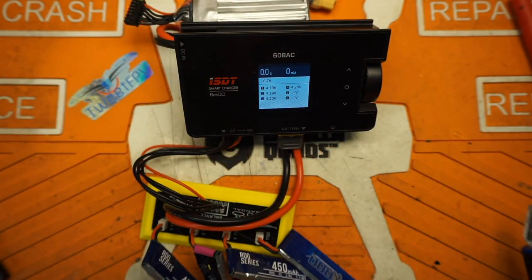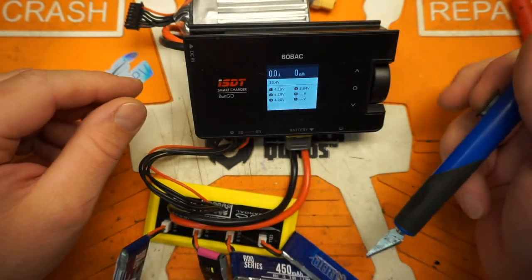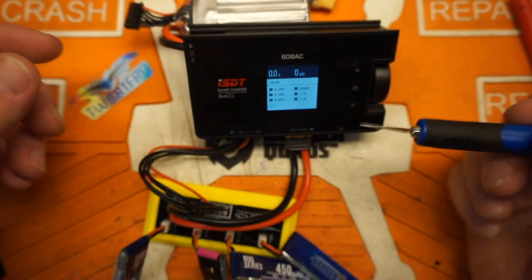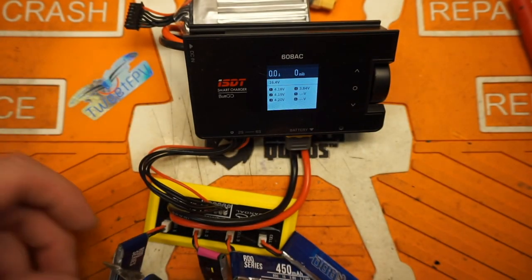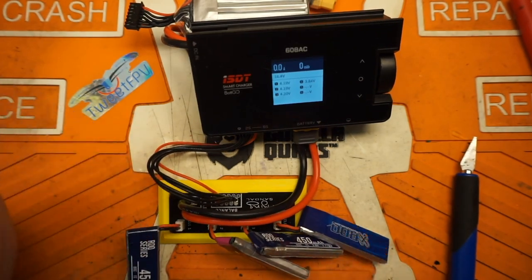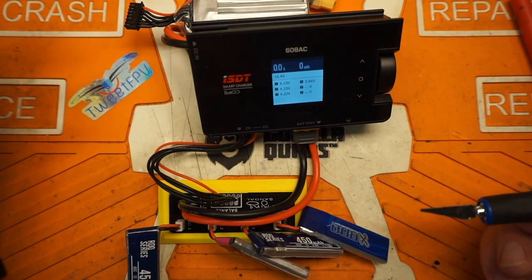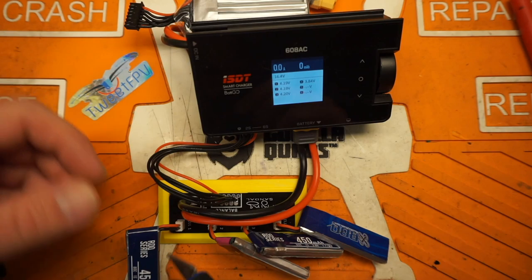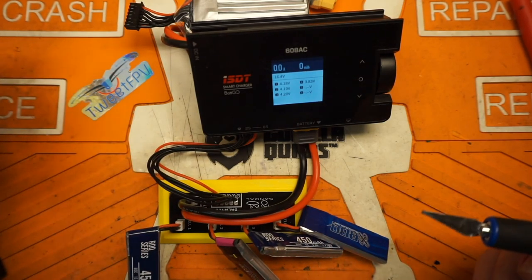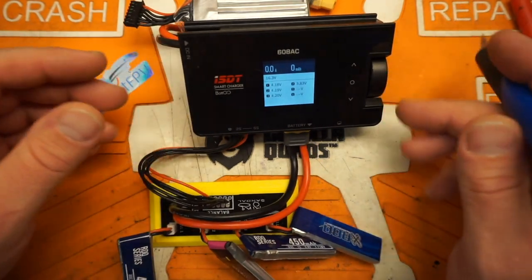If there's a cell voltage mismatch, it doesn't really matter. So if I did this on a parallel board, like this guy here, we would probably run the risk of having a fire because this battery pack here is much lower voltage than the rest of these ones here. With a series board, it doesn't matter at all because there is no electron flow in and out of this because they're all in series. Whereas in parallel, yeah, most likely a fire.